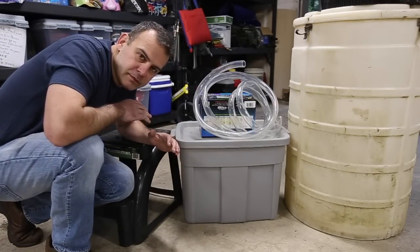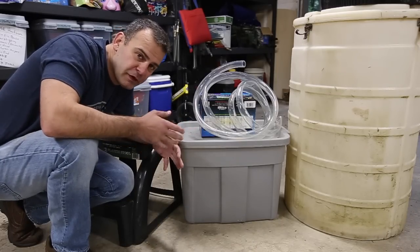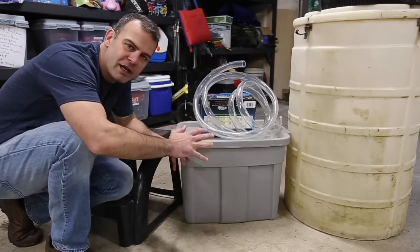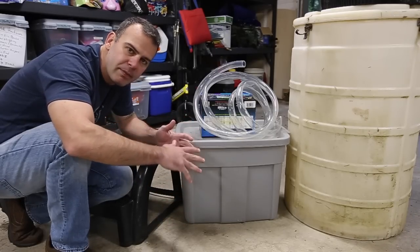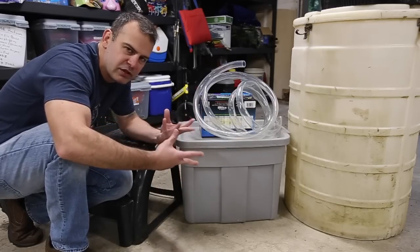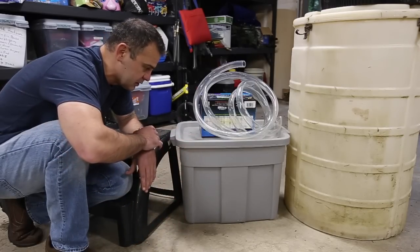A biological filter doesn't use physical, well, I guess they're physical things, but you can't see them. You're using bacteria to filter out the nitrates from your koi's poo-poo, okay? So what you do is you fill this up with things that have a lot of surface area, scraggly, scratchy things. You can use scrubbing sponges, like Scotch-Brite sponges, plastic balls. They make bio balls, but it's just something that has a lot of turns and nooks and crannies that won't break down in water. So plastic is good. And that's even simpler in the sense that you just fill it up with that stuff.